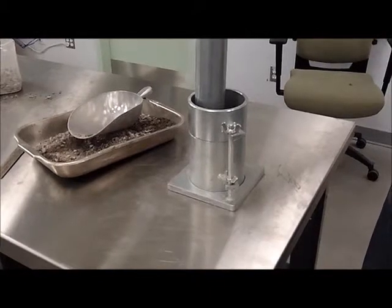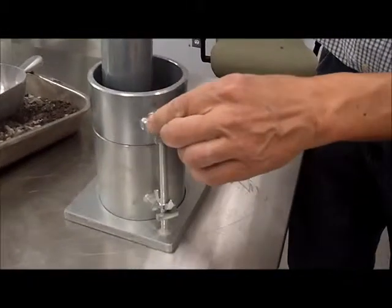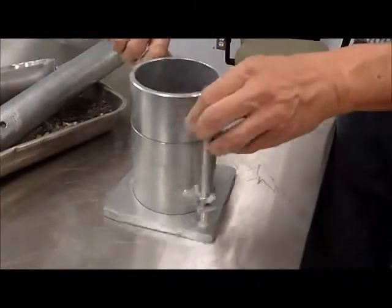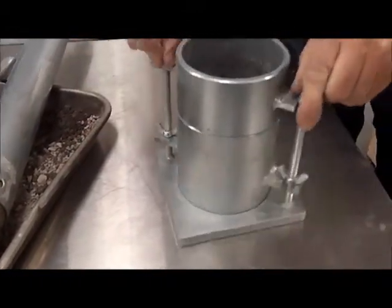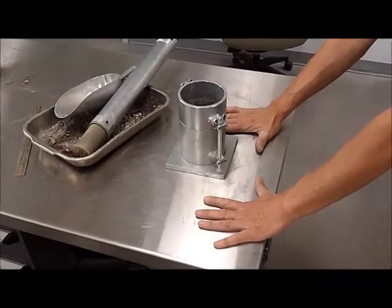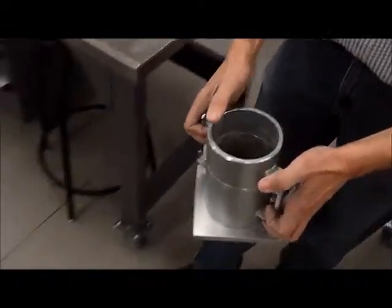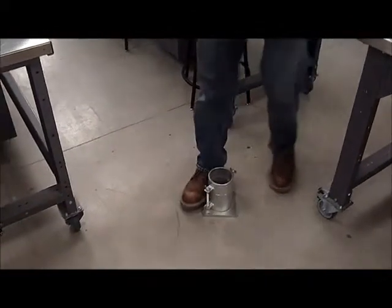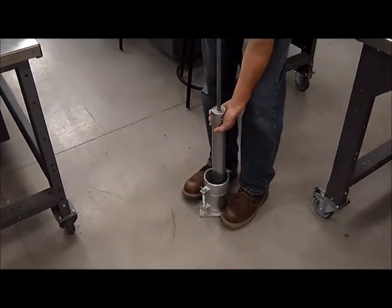Something I'm doing wrong here is quite evident by the noise that you hear. First of all, the test equipment hasn't been tied properly, which means the collar is loose. Also, I'm compacting not using a very stiff subgrade. This, in spite of being metal, is not as sturdy as if we were doing the compaction process on a stiff concrete surface. And you're going to appreciate that with the difference in sound.